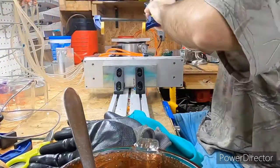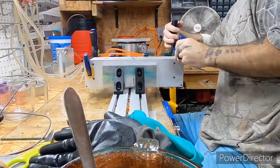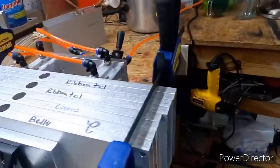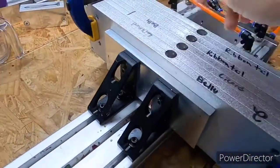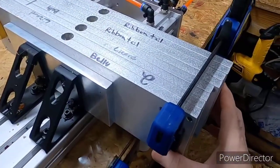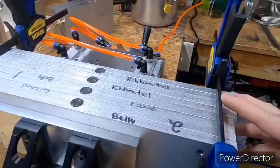And you don't really necessarily have to do this. Once you put this air clamp on, it holds pretty well, but I like to put those clamps on the sides. Main reason I do that is sometimes if you're holding a lot of pressure, because these molds are real long, you'll get a little bit of flashing on the tail ends, and I hate flashing.